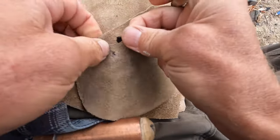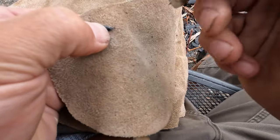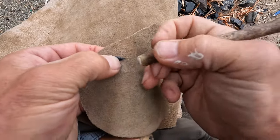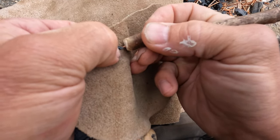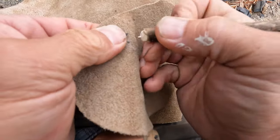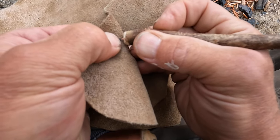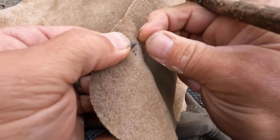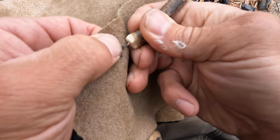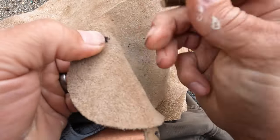There's a little bit of a high spot on the very tip — a little overhang making the tip not quite as sharp as it could be. I'm going to try to pop that off. There it is — that brought that tip into the proper form. I like that. True up the tail end just a little as well. And that is really all there is to it — once you get it ground to shape with your stone, you're just pecking that edge and flaking little chips off.